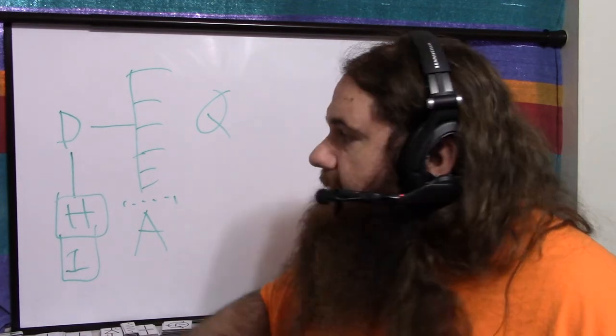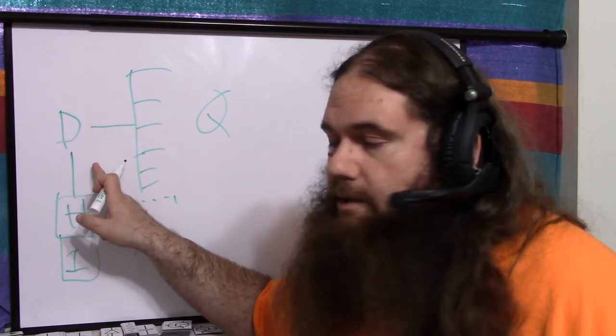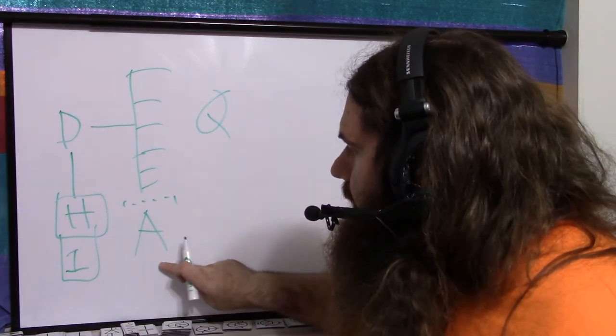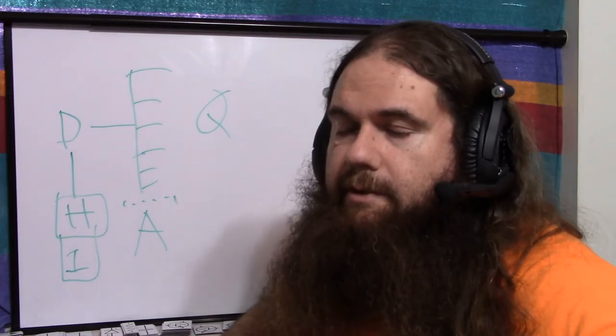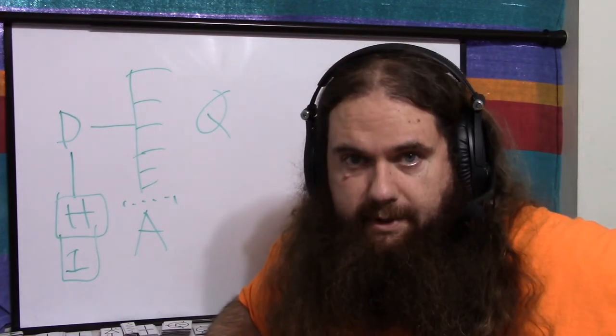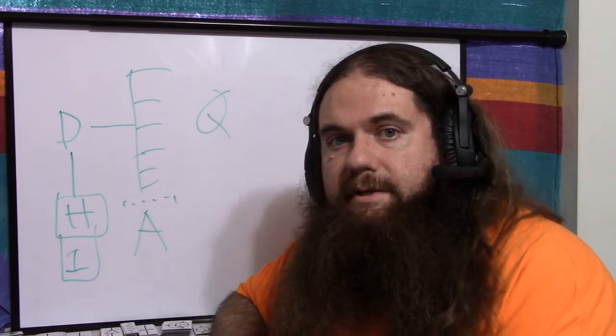It's the same thing. It's a transparent latch. So data is always going from input to output live based on address whenever write is enabled. But by resetting all the other pins, you go from register to demux or decoder.